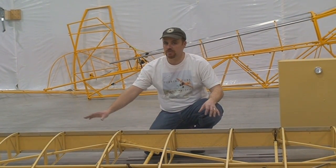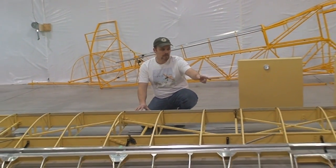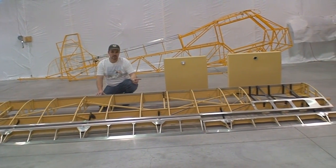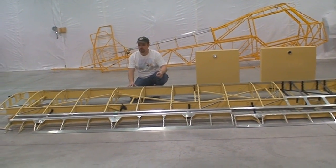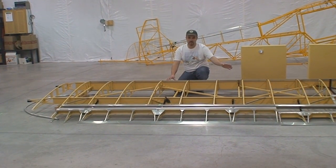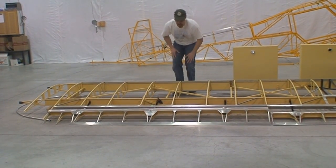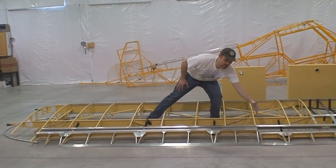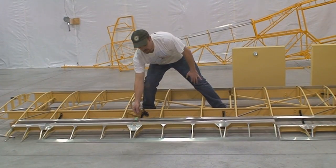Now, with the original bow-tipped design, you can see on our flaps and ailerons, the flaps have 2 hanger arms, aileron has 3. The flaps are 66 inches long, and our ailerons are 102¼ inches. What makes our squared off extended wing so desirable is our flap actually has 4 hanger arms and is 10 feet long. Put a piece of tape here so you can see the difference. Here is our split on our flap right now. Our squared off wing, the flap comes all the way up to here.